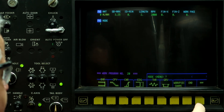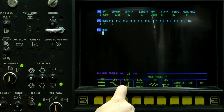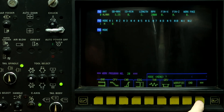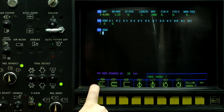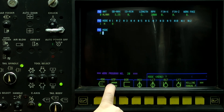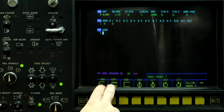First thing we're going to do is push the three arrows. M code. Cooling on. Down arrow. And now we're going to program a series of three tapped holes in the face of the part. So we're going to push the right arrow twice. This gets us our milling menu, and we're going to center spot drill it, then drill it, and then tap it. On this older control, you have to do those in three separate processes. On the newer machines like the Smooth X control, you can just push tap, type in the tap information, and it will automatically come up with the tools for the drill and the spot drill based on what's already in the machine's tool chain. But on this older machine, we have to do each individual process manually.